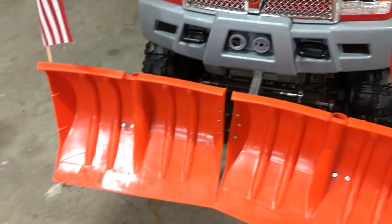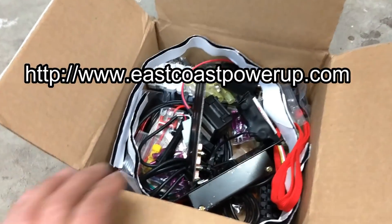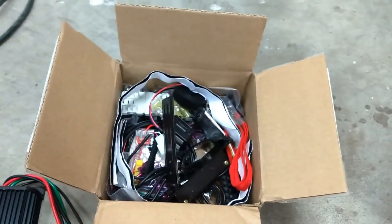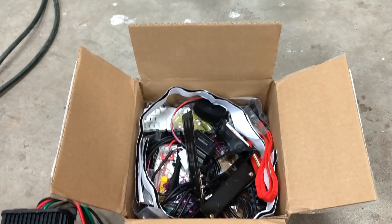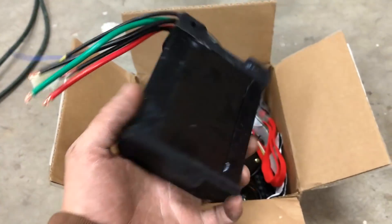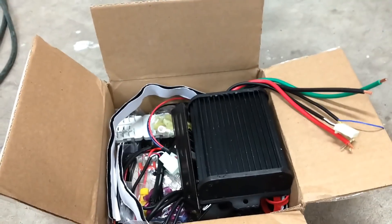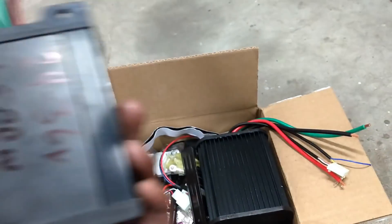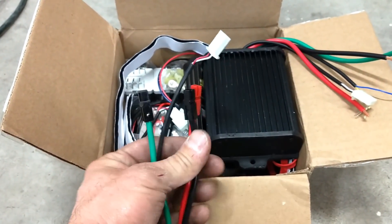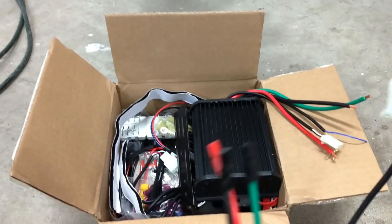The next update you guys are going to see is all about the electronics. We've got our East Coast Power-Ups kit — we're just going to run this on 24 volts. We're going to use 18-volt Bane-Bot motors. Wesley over at East Coast Power-Ups does a phenomenal job putting an all-in-one kit together. It comes as a 1,000-watt kit. This is the ESC, or speed controller. Because these motors, I'm sure, draw more than 300 watts each — that'd be 1,200 watts. So we've actually upgraded it with a 1,500-watt controller. We've already switched out the leads and we use these Anderson Power-Poles.